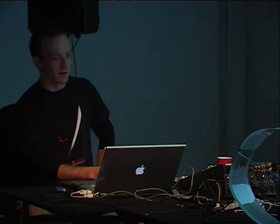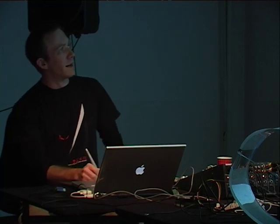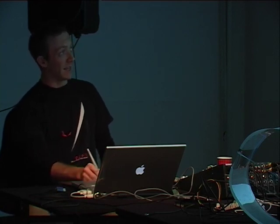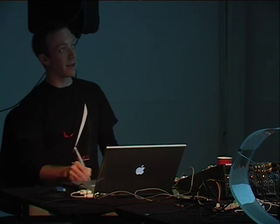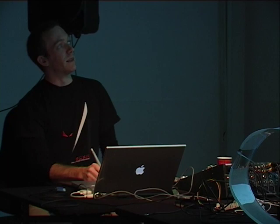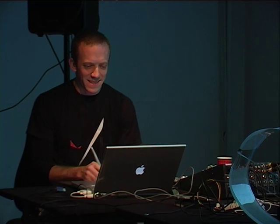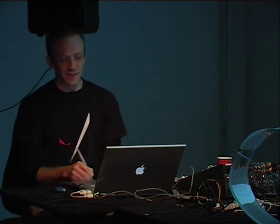We can also think of this in terms of maximizing the utility. Time is money, so we want to make things quick. Rapid development is really important so that we can do all these experiments and find out what's going to be the next interface. Cross-platform is a good way to achieve some of these things. And USB serial is a cross-platform transport, and it also provides power, which helps reduce costs as well. And this is where Open Sound Control starts to fit into the picture. It makes things easy to understand, which I think is important. And I can argue that Open Sound Control helps us maximize the hardware performance, and we'll see exactly how that plays out later. And this USB serial transport is making that possible.